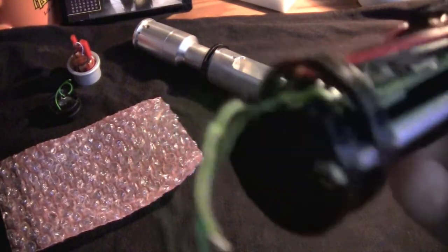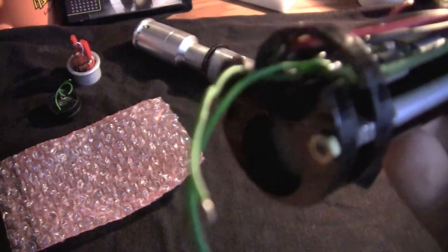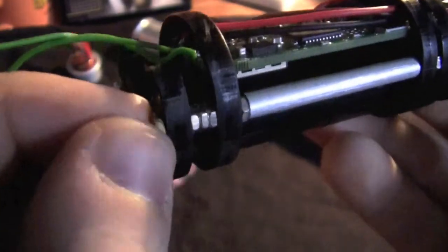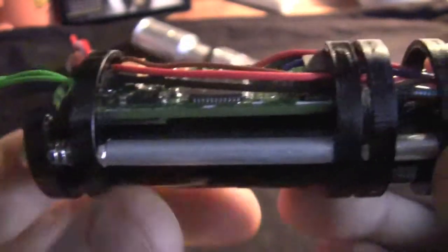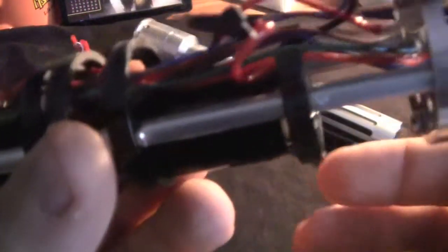The chassis is held together with 4-40 threaded rod, spaced by aluminum 3/16-inch spacers. I got the 12-inch section and cut it by hand using a saw. I used 4-40 threaded nuts to help secure the chassis. When I cut the threaded rod I left these two ends pinched so the nuts can only thread in one direction and won't come off on this end. A couple of extra nuts act as spacers where there was only a small gap rather than cutting the aluminum spacer with the saw.